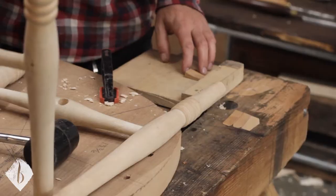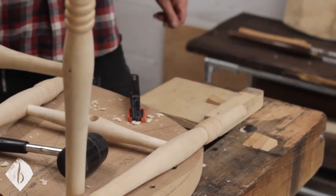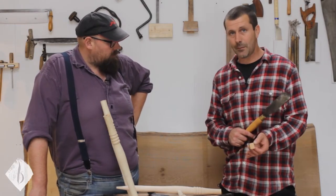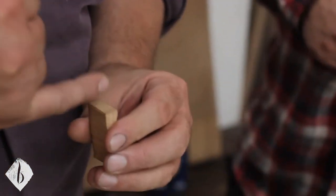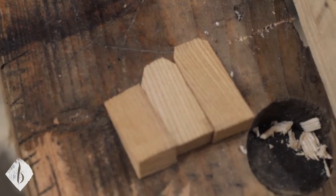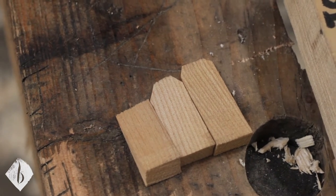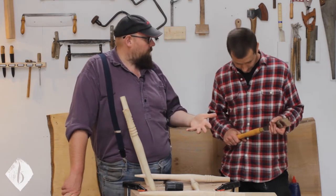Go for something tough so you can hit it hard and it all bangs in. As for grain orientation, you want it oriented along the grain just to stop any snapping. Looking at it end-on, that's like quarter-sawn - but actually that direction doesn't really matter. These are obviously being sawn from a bit of elm, which would be quite tough to use a draw knife on if you've just got it from a plank.